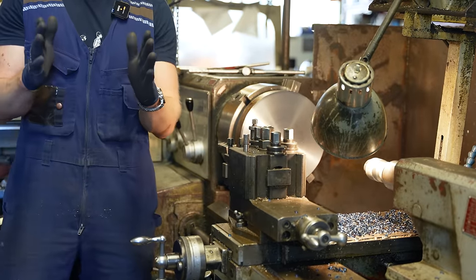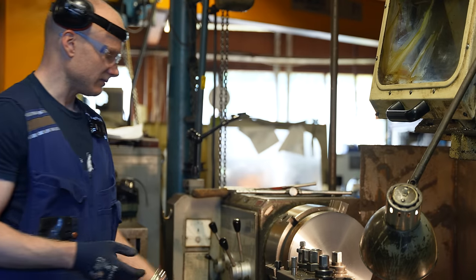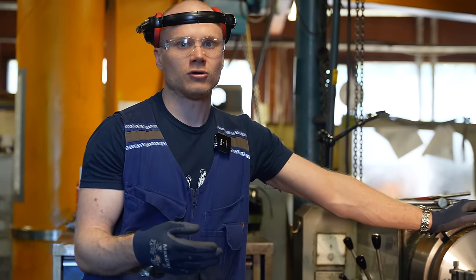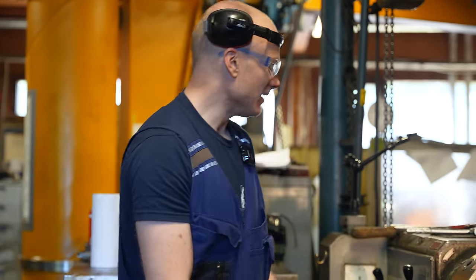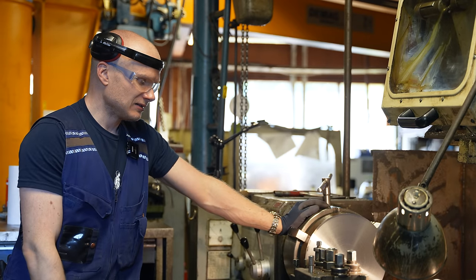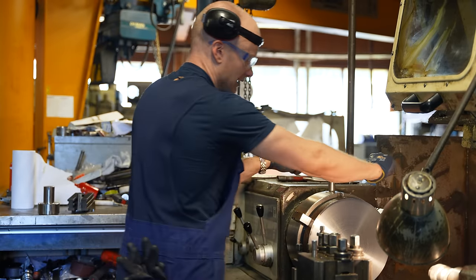So in this distance, there can be 0.2 millimeters of difference in diameter from here to here. And that's a lot with a lathe this sized. If you are, for example, doing a ball bearing mount of this diameter, you have 0.02 millimeters of tolerance there or less. So that's 10 times that. So not optimal. And we have a Chinese lathe, same sized. They're waiting to be a replacement for this, but I think we are going to just keep both. This is so nice. I'd much rather do work with this when I don't need the accuracy than with any other lathe.